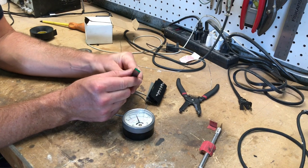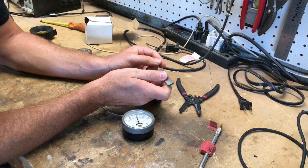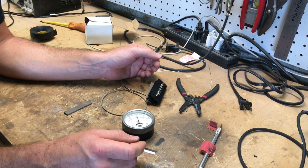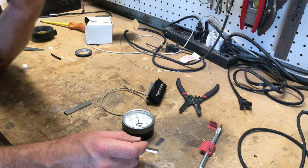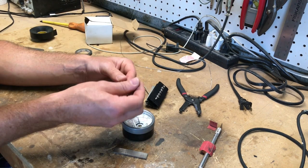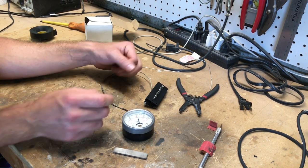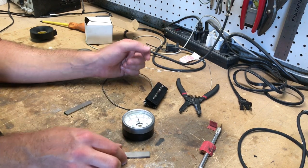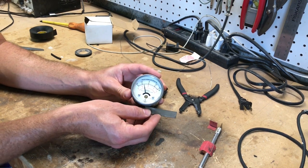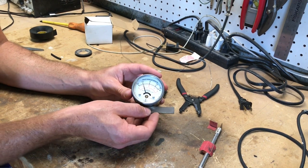It's time to put the bar magnets on. These are Alnico 3 — you can tell by the green color. We're going to make this coil south up, so it will be counterclockwise south up. That will mean it will be in phase with most humbuckers and other pickups. Some of these were made north up. You can't switch the phase here because this is ground and this is positive, ground is attached to negative, but you can switch the phase by going in and flipping over the bar magnets. It's showing about 25 gauss — that's good. You can get meters that are a little more accurate than this, but for our purposes that's fine.